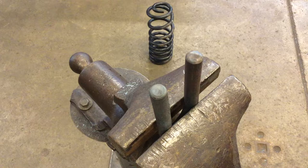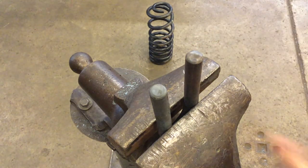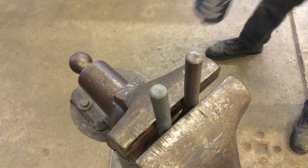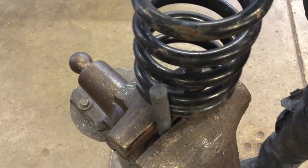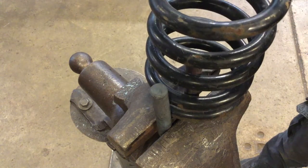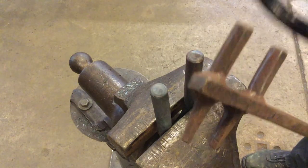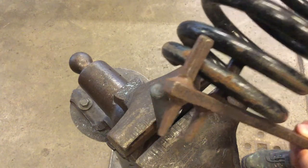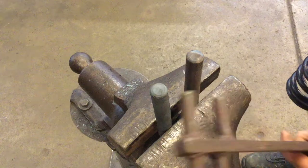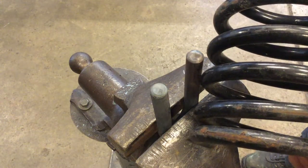So before you start unwrapping the helix, you want to make sure that you have a U-bar locked in your post vise that can fit the spring steel so that when you do get a straight section, you can start unwrapping it from that helix. Also want to make sure you have a set of bending forks that fits around the diameter of the rod you're trying to unwrap. These two pieces of tooling will be essential for unwrapping this coil within a heat.